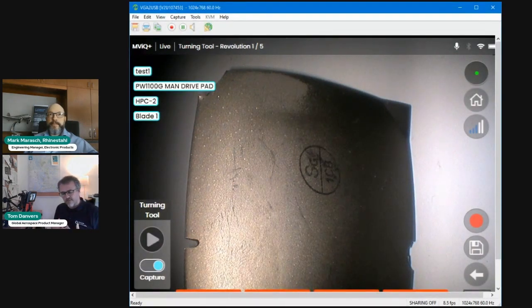So I've set all of those things that you heard Mark and me talk about earlier in terms of making sure the engine type is set, the backlash is set, the stage is set, and I've jogged it to the correct blade position, and then I press that set view position number. So let's just jog it and I'll just show you. I'm jogging the motor now, and it will go to blade 2 shortly. So you can see it's gone to blade 2. Let's say for demonstration purposes, this is where I want it to be. So I'll press my set view position, and you can see the count return to 1. And effectively, that's truly 1.00, in as much that that is your datum position that you want to start your inspection on. So once you've done all of those things, you're ready to press the button.